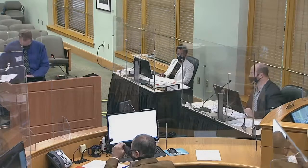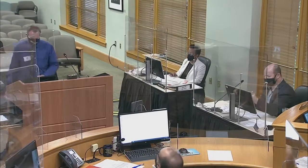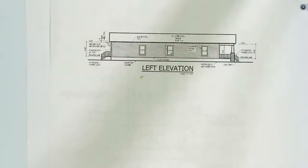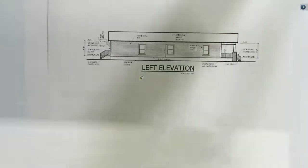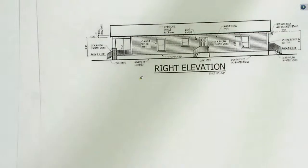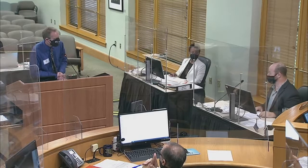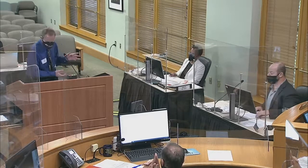We talked about the stem wall at the last meeting, and I think you've shown that condition here, but I think that's an awfully long stretch. Typically with these craftsman style or historic houses in the district, on the front, you have the brick pilasters for the covered porch, which gives it a real nice street front presence on your south elevation. But as you start going down this building, I think that needs to be broken up. Usually in the district, we'll have brick pilasters, and you can use a thin brick, similar to the same brick that you used here, just to break up that lower stem wall facade. Along that, I'd say maybe add three or four pilasters to make it more historically consistent, and everything else I think looks great. I'm sorry, just for clarification, that would make it appear more like a stem wall?